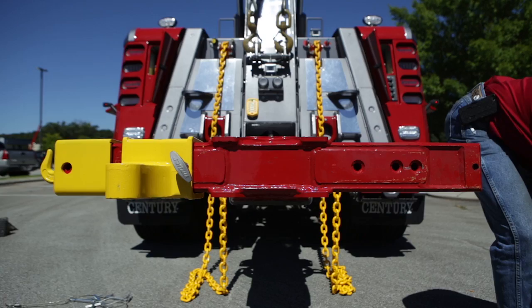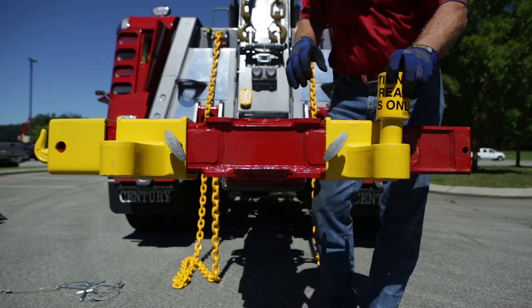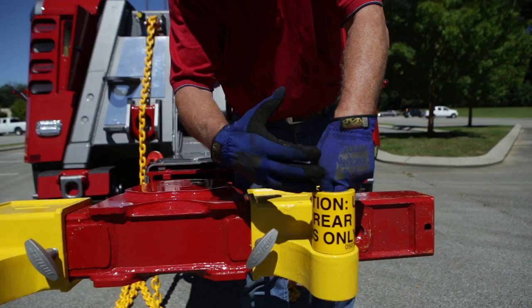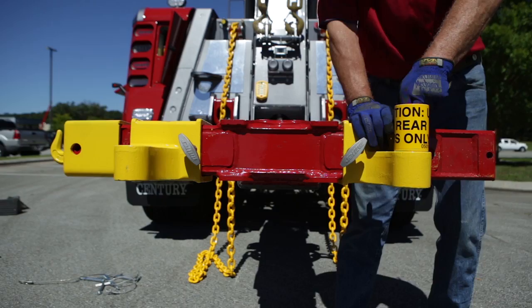We've left out two attachments on purpose. Like all Miller units, we have our very favorite towing spots. Right here in the back of the wrecker we have the u-bolt attachment, which picks a vehicle up from the rear — rear only. You put that right into where the spring bolt would be coming down, and it just lifts right up into that socket. We have our ratchet strap or chain to hold it down into the attachment, and of course our safety chains.